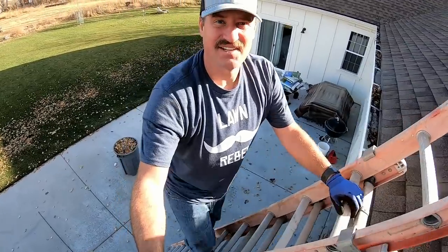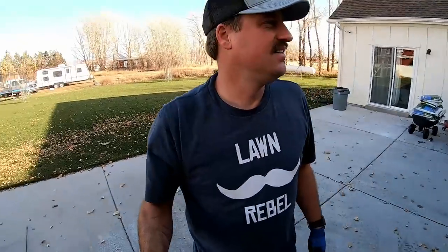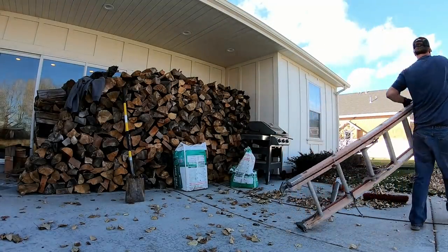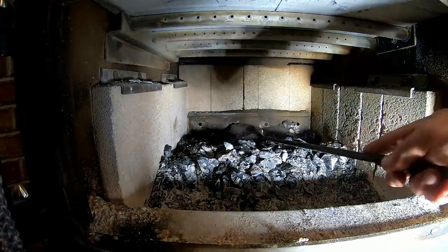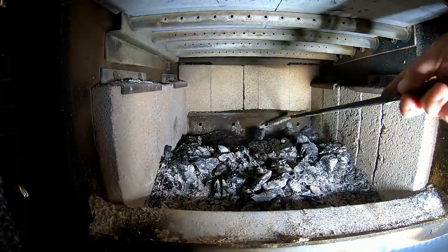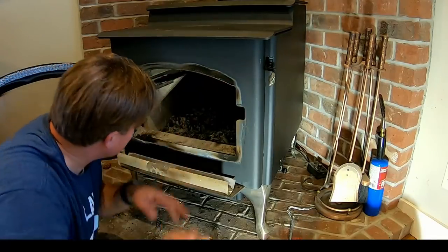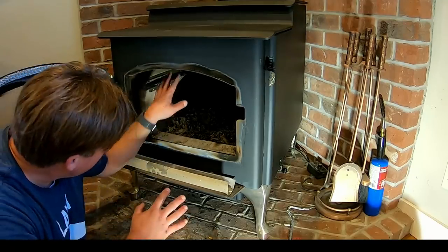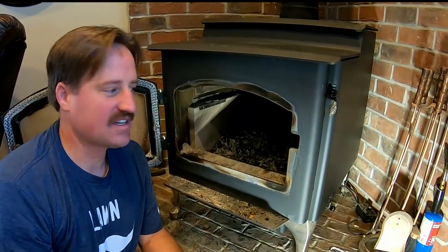Now I'm going to go inside and look in the wood stove and see how much ash or soot I swept out of there. You really should have some kind of safety gear on — PPE for ladders or something. There's the ash in there. You can see there's a fair amount — it's just that black stuff that was there. And that is pretty well all it takes to sweep the chimney. I did pull this ceramic piece forward so I could get the ash to fall forward a little bit. That project is complete.